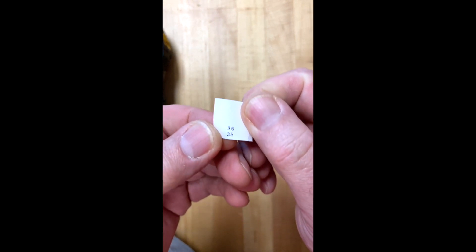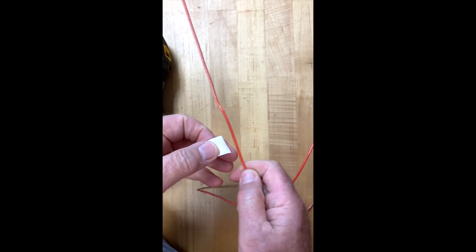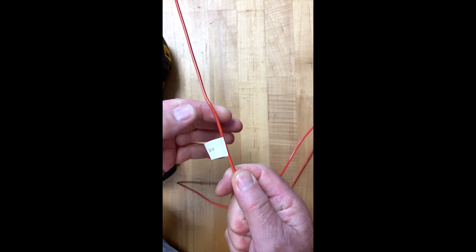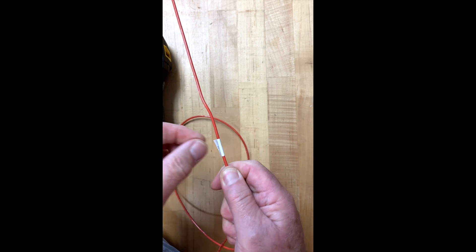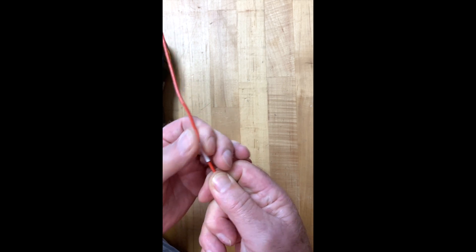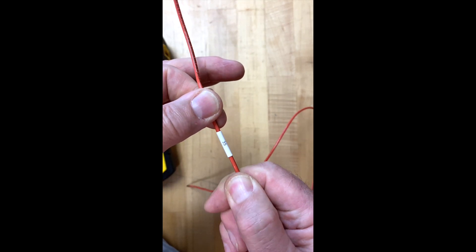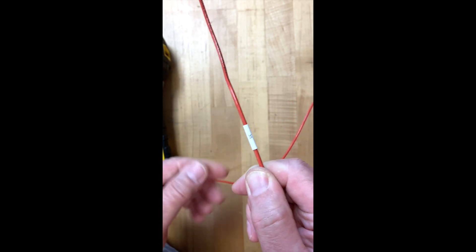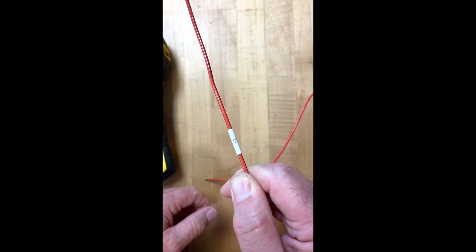And again it's going to come out over here on the side. I'm going to push my buttons on the back to cut it off, and then we have this wire marker. I'm going to get my number 14 wire, which is right here. I'm going to start by putting this on the wire just like this, and I'm going to roll it around and wrap it around that wire. And look at that — I've got in my control cabinet now a wire that's marked wire number 35. And it's neat, it's clean — it's a little cleaner than the flag label that I just showed you.